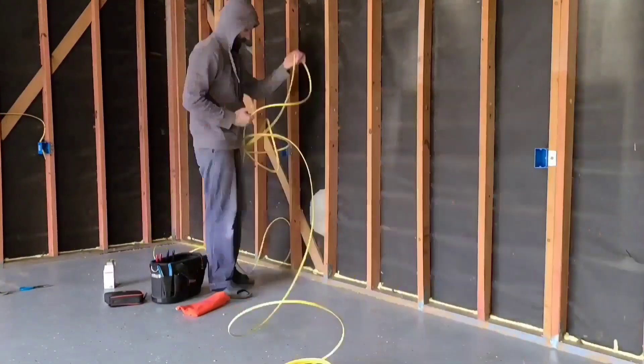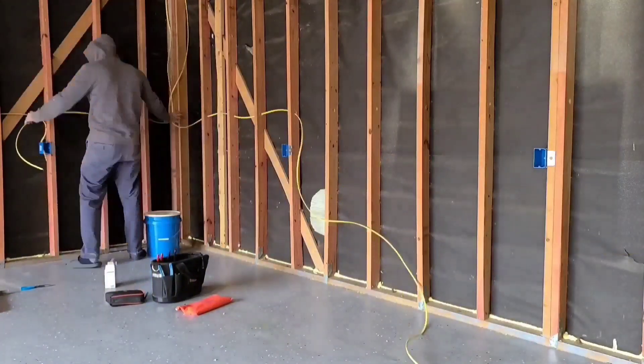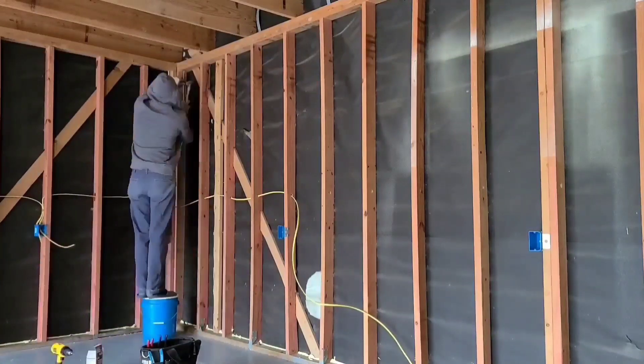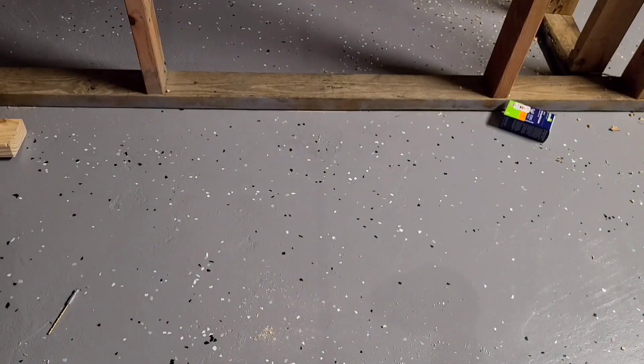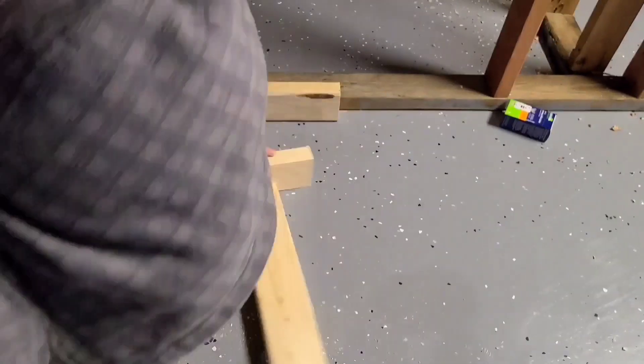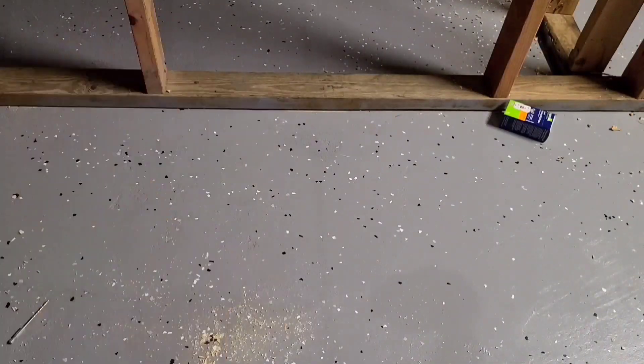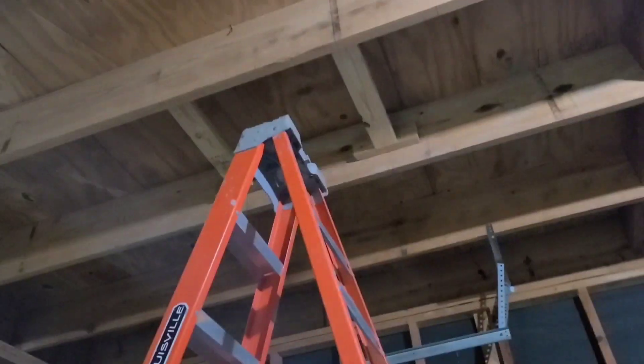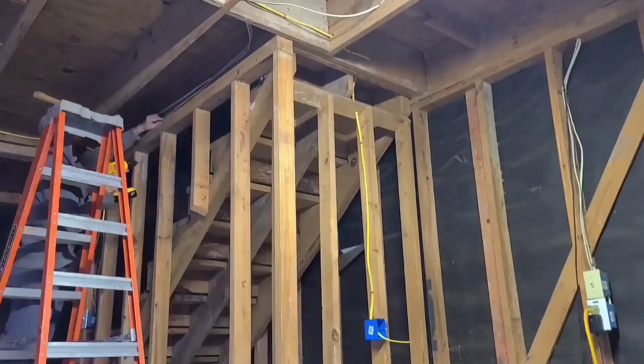For the initial setup, I left a foot of wire outside the box, and after inspection the extra wire was pulled back through, just in case anyone down the road wants to make adjustments. For the lights, I built small frames that could be put into the recessed parts of the ceiling to give maximum clearance and allow for the possibility of drywalling the ceiling later. Six T8 lights were evenly spaced out and held up by two screws into the new frames.